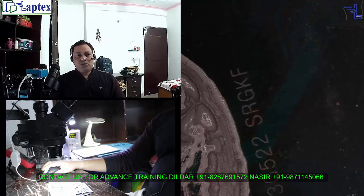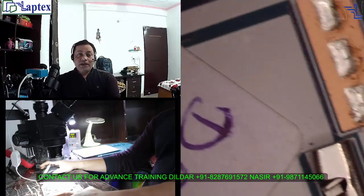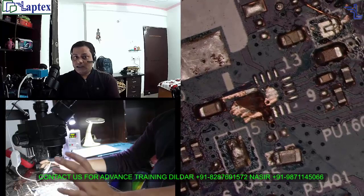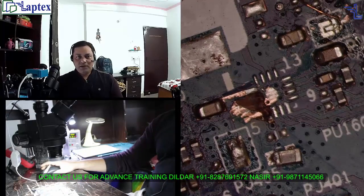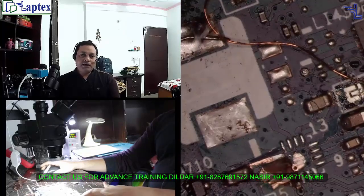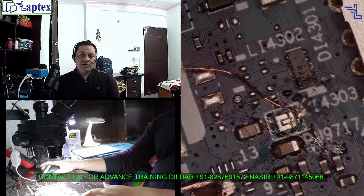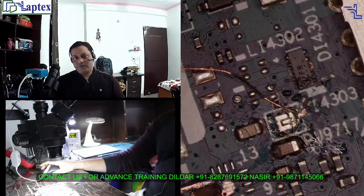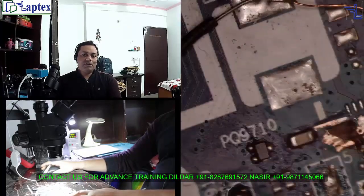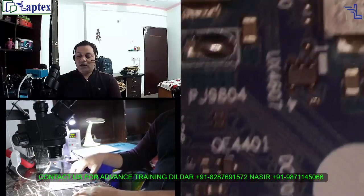If we receive this type of motherboard and you have never done this kind of manageable work, the problem you will face is: when you connect a buck regulator here, you have to deal with two things — first, from where you will give the power good signal, and second, from where you will give the LDO supply. If you try to connect the 3.3V LDO to the 5V LDO it will not work, because it is responsible to enable your LVIC.